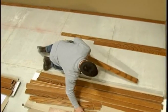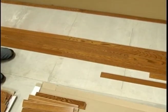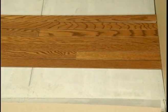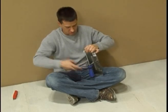When you spread your adhesive, take care not to apply it too far from your reference line in either direction. Ideally, you want the adhesive to end exactly at the last board you will install on this pass. Leaving enough workspace between the backer board and the first row, rack out about three feet of flooring. Stagger the end joints on adjacent rows to avoid stair steps and H patterns. Also, check for damaged or discolored boards that may stand out when the job is finished. When you're satisfied with the rack, spread the adhesive approved by the flooring manufacturer along the working line. Be sure to follow the adhesive manufacturer's instructions regarding the spread rate, trowel size, open time, and flash time. Many installers tape their trowels with duct tape before spreading the adhesive to make clean up easy.